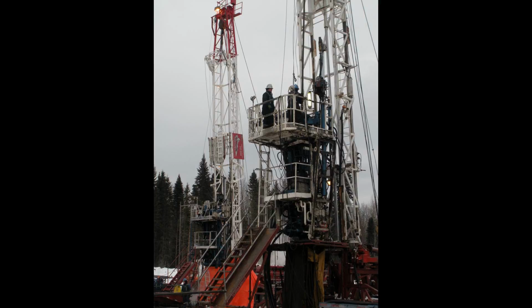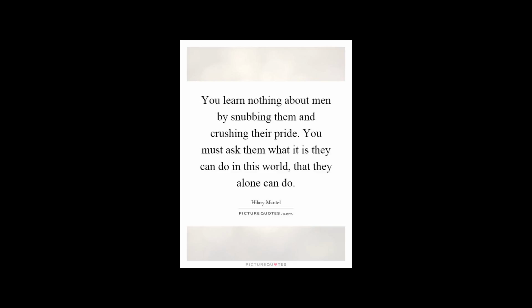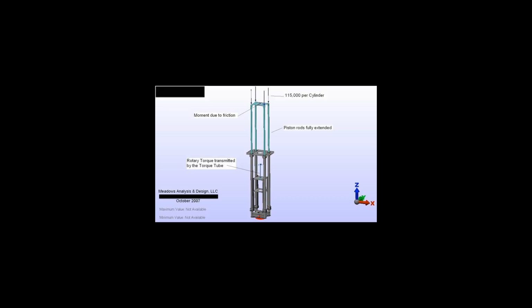Although problems such as the one described above can happen, they are extremely rare and always avoidable. In the case above, adequate supervision could have prevented this dramatic consequence of operator error by limiting the hydraulic force allowable to be applied to a level below what was required to part the pipe string.